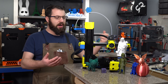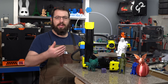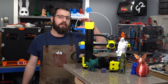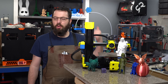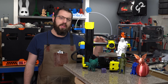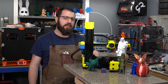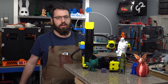Comparing this to other printers of the same type is hard — I don't have a Prusa Mini, and the last cantilever printer I had was a Monoprice Select Mini, which is nowhere near the same class of machine as this. I know a lot of people compare this to the Voron V0, however I don't really think they're in the same category — one's a CoreXY, this is a Cartesian gantry style machine, this has a 180mm bed whereas the Voron V0 has a 120mm bed. For those looking for a mid-size to small 3D printer, specifically one that you can build yourself, definitely give this machine a look.